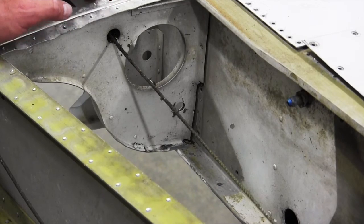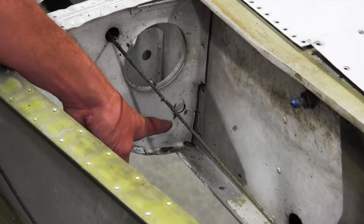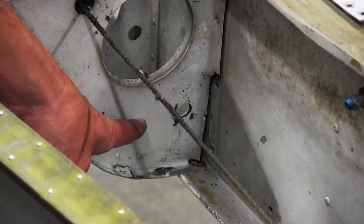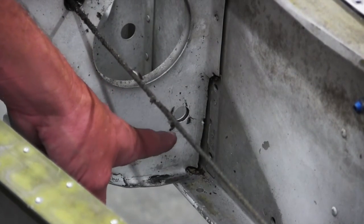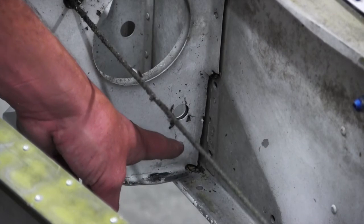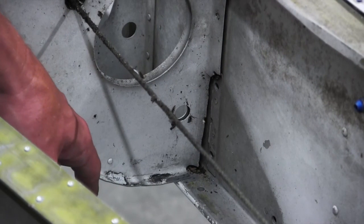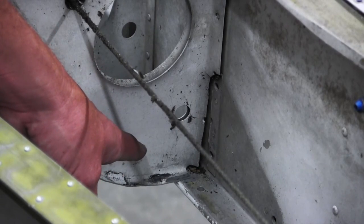On the inner rib of the wing you can see the cracking that has occurred on the flange. This is what Piper Service Bulletin 1161 deals with — looking for cracks behind the trunnion block. You can see this has been cracked out and actually torn away due to hard landing, but normal wear and tear on Piper retractables will also cause cracking in this flange area.